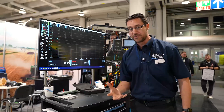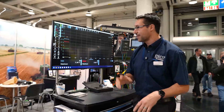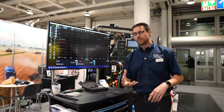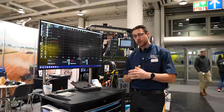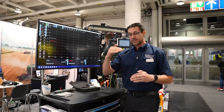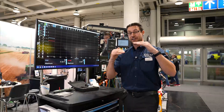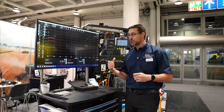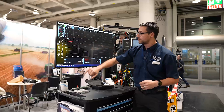This isn't the most exciting of waveform captures, however it gives you an idea of how efficient that cooler is. If there were any problems - maybe blockage, or dirt and debris building up within the core of that radiator - we should start seeing that the difference between the inlet and the outlet temperatures are not where they need to be in order to make that cooler work as well as it should.